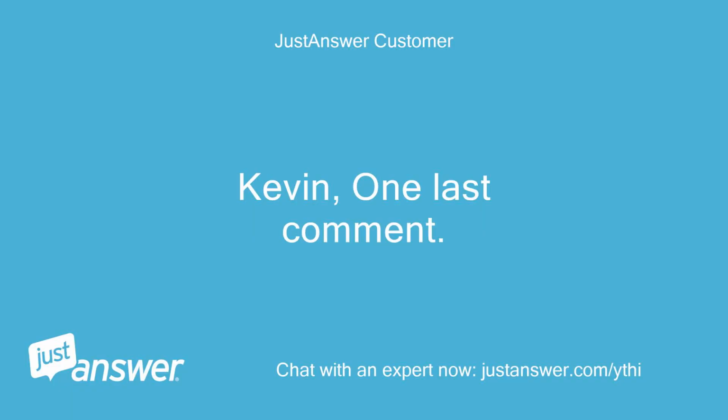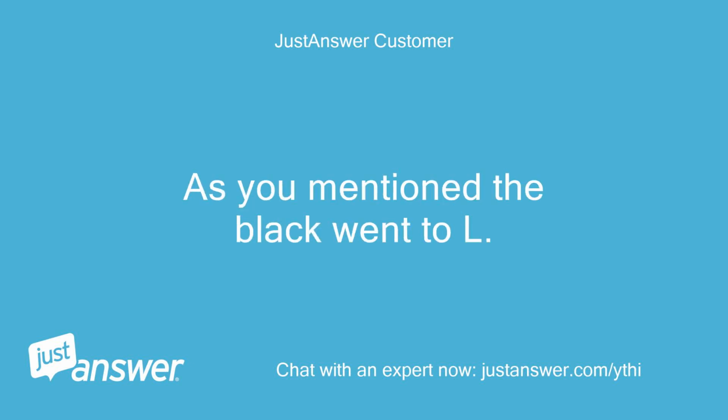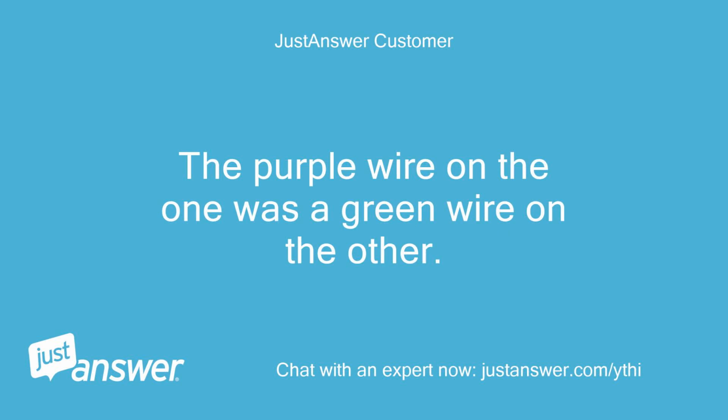Kevin, one last comment. I checked another Hunter fan and it had a Zing Ear 3-way switch. As you mentioned, the black went to L. It also had the gray, brown, and of all things a purple wire. I was able to then see where the wire connections went, and the new 3-way switch in the other fan worked perfectly. The purple wire on the one was a green wire on the other.